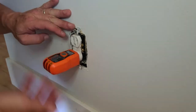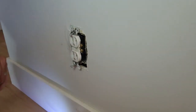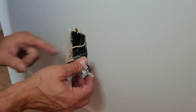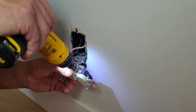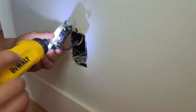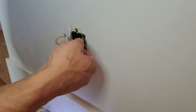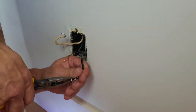Just so you know, I did turn the power off — we have no power here. Very important step: shut the breaker off at the panel. Let's pull this off. And right here we have aluminum, and we have a piece of aluminum here for the neutral. So what I'll do is I'll open this up. The one at the bottom here is the neutral. We can really just get rid of that old outlet. It's good to stretch these wires back nice and straight.